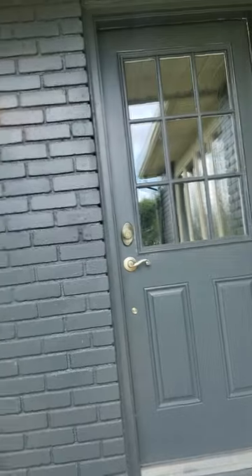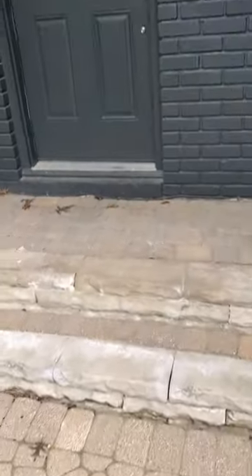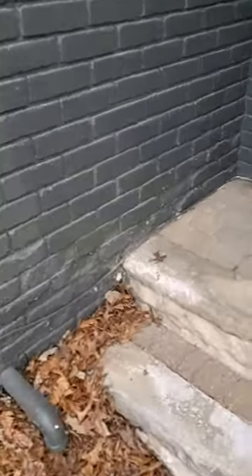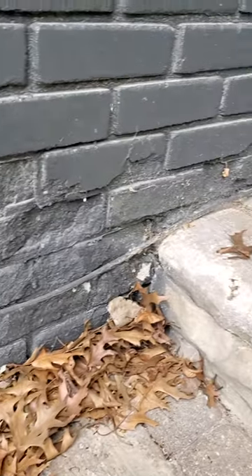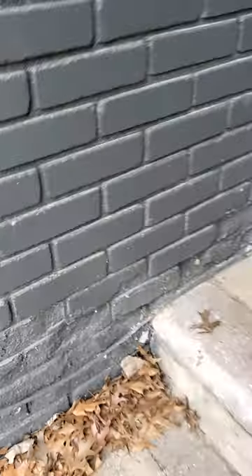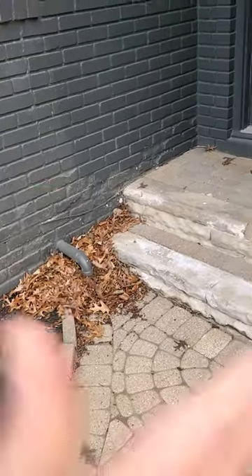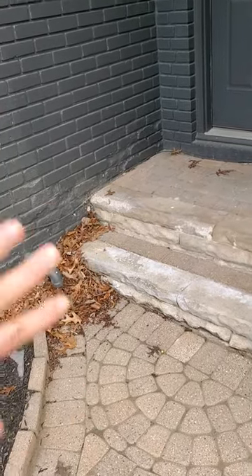If you can see here, I'm by a back door, and this is a really common area. See all the brick here that looks deteriorated, a bit damaged. This is a very common area to get spalled brick around porches, back doors, things like that — where we're shoveling all the snow away from our walkway but not getting it away from the brick, so it tends to pile up there, or we just push it to the side and it stays piled up against that brick.